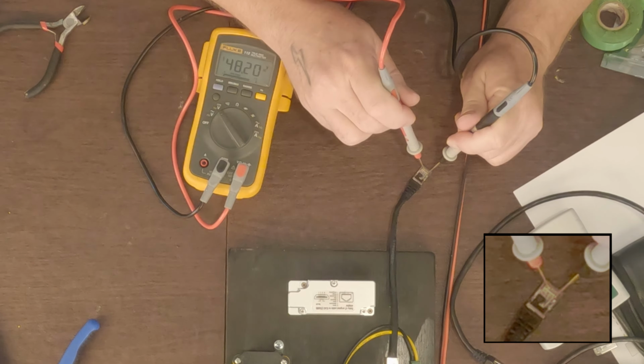So we're going to take the end we crimped, and we're going to place it in the PoE injector here. This other cable, which I also rebuilt, is plugged in the same way with the end that was custom crimped on it. And then this is going to go into the WAN port of the router, which is right there. And now we're going to go ahead and fire this up, turn it on. All the cables are connected.